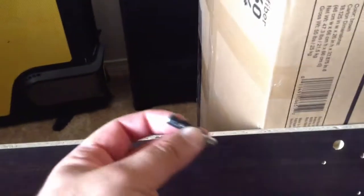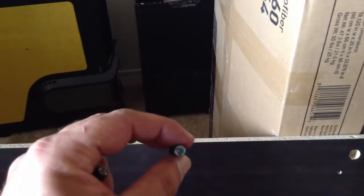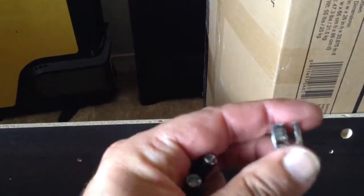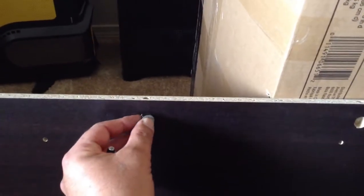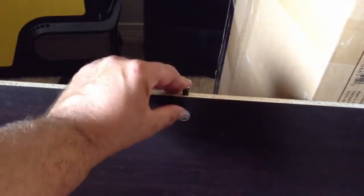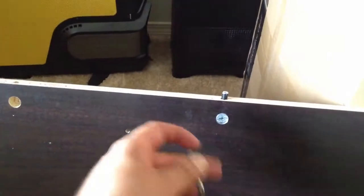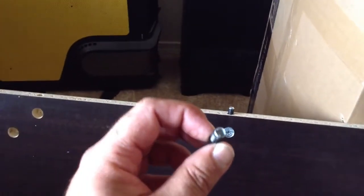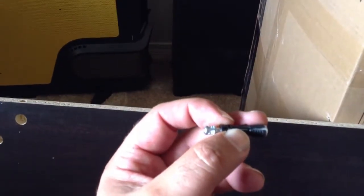What's unique to this stuff — and interestingly enough, it's all made in Archbold, Ohio. This is not quite the same as the IKEA cam system. You see how it doesn't screw on, and then you have the other cam to go on. Now these look similar — very similar — they function about the same way, but the way this system works is you push this in. Now you have an open side and a closed side. You see how that cam lock works — very similar to the IKEA thing in that the open part will face the hole. Then this piece goes in and you want to make sure it sinks all the way in to where it will actually contact that.